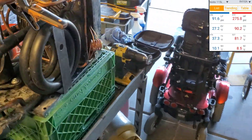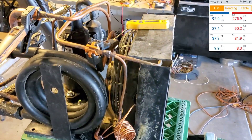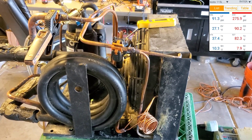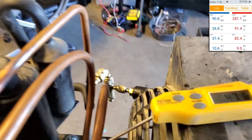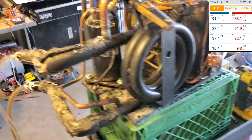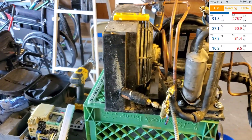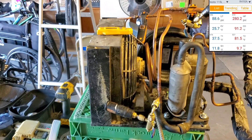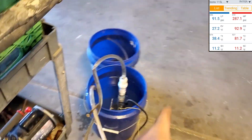I don't want to add any more refrigerant. You'd think you'd be worried about something like this freezing up, but it hardly ever gets down to freezing here. And the water heater runs like an hour and then will shut off and not heat again for hours usually. So any ice that starts building up on that sucker would probably just melt off from the ambient air. Still dropping — 46, 47. So we're getting 18, 19 degrees split temperature. Everything looks pretty textbook right now, other than suction is just a little low, but normal still.